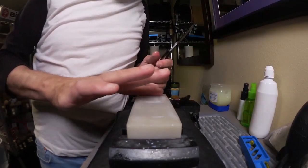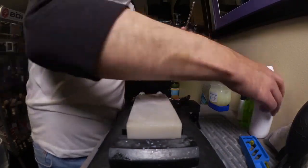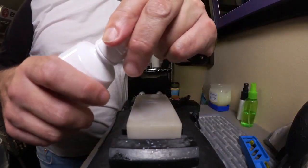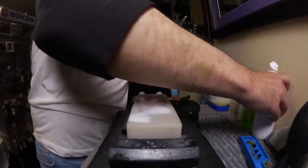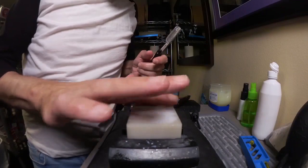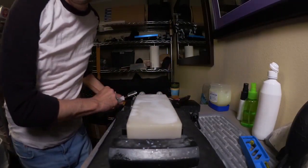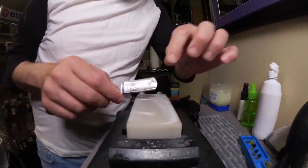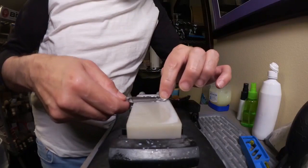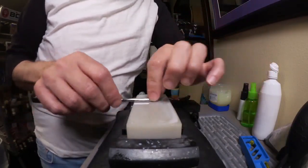And these old Nortons, in general, the whitish translucents seem to cut a little bit faster than any of the black surgical ones. I know this has nothing to do with the black or the white color, because I'll take a napkin and compare how much swarf I have on it after running a razor on a stone for a while.